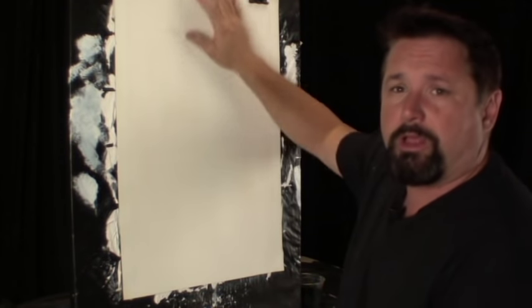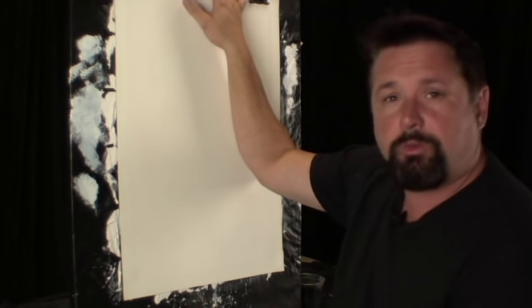My glaze is going to be the classic wall glaze. Classic wall glaze is an acrylic glaze. It's an interior-exterior glaze, and it tints with paint. The reason it tints with paint is that it does not contain any dryers, meaning it won't dry. If you put the glaze on the wall or surface, there's nothing in it to make it dry.